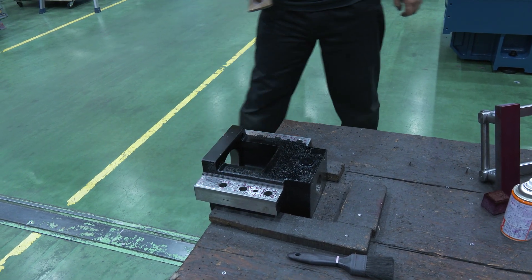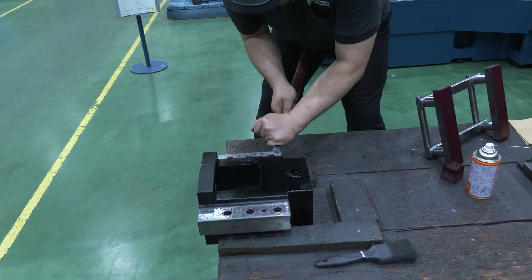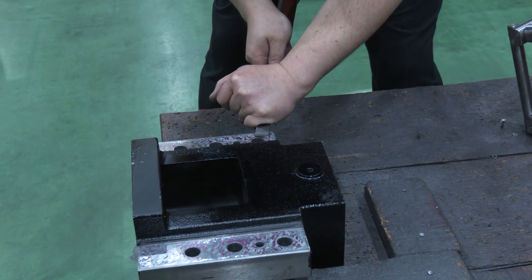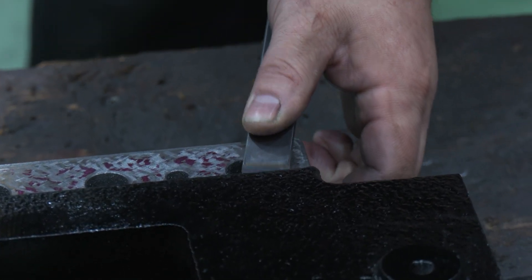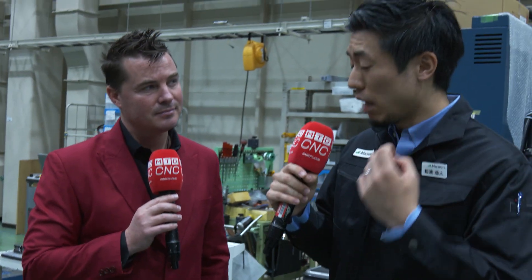Our technician here, in addition to having a good scraped surface, makes a micron-level adjustment to cancel the deformation — a careful adjustment so that the machine achieves mechanical flatness. This is the key to reliability and longevity. We believe that our beloved customers like our products because of this.